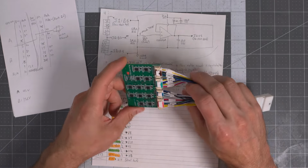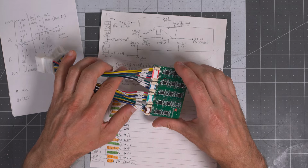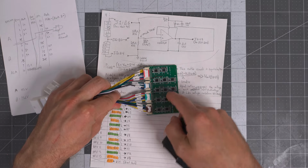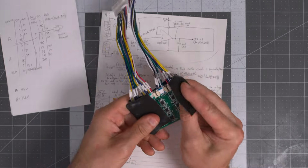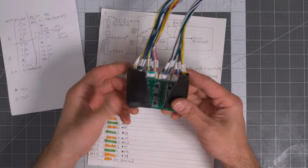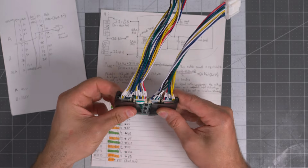And then, of course, the creepage and clearance on this PCB, I kind of mentioned that briefly. This is high voltage. This is directly connected to the battery. There's no fuses on this. The traces would have to burn, I suppose. And again, it has a conformal coating. It's not very well applied. And then it's just put in heat shrink. And then it's literally just stuck in the car, between the metal chassis right by that battery support module. And yeah, talk about ways to burn the car down.